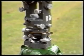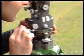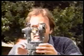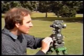Ideally, the initial reading on the theodolite when pointing to the reference object on face left should be slightly greater than 0 degrees. This simplifies subsequent calculations. This is how we measure horizontal angles: in the face left position, open the mirror and free both plates. Set the horizontal circle to give a reading between 0 and 1 degree. Clamp the upper plate and you will retain the reading. Point the telescope at the ranging rod using the sights on top, then clamp the lower plate.